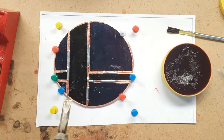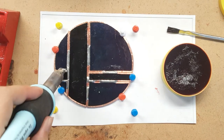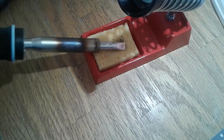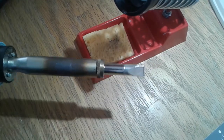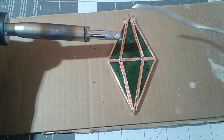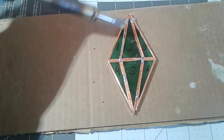The fan helps to keep the glass cool, but it can still overheat. I have heard of using ice to cool the glass, but I don't recommend it — the ice can cause thermal shock and crack the glass. Every once in a while, I rub the iron across the wet sponge to clean off carbon buildup. Don't put the iron back on the stand right after cleaning it. Apply a small amount of solder to tin the tip, which stops it from oxidizing by creating a protective layer between the air and the iron.